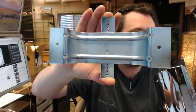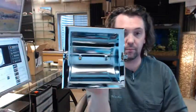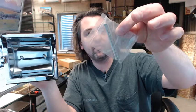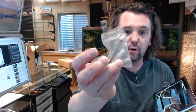Into these flanges between my middle finger and thumb are several holes that are drilled. It is through these two holes in the back — those two dimpled holes — that you would run these long 8-32 flathead bolts, which are magnetic. When you get this installed and run those screws through the holes, it will go into the tapped holes here and draw the clamp towards the inside face of the drywall. So that is an alternate way of mounting this, or of course you could always, if you had the reinforcing, just take those screws without the anchors — which are magnetic — into these two dimpled holes and run it in.